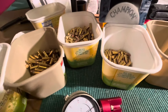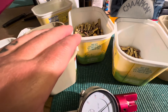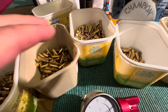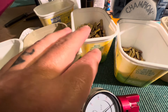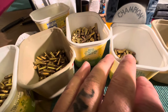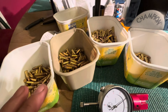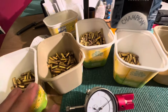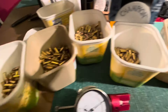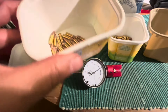When I was sorting these, I found a good portion of them were right on zero - or what I call zero. I've sorted these a little more precisely this time. This is plus or minus a half a thousandth of my zero setting. If it went to one thousandth plus it went over here, one thousandth minus it went over here, and then one and a half thousandths went over here on either side - three pieces in those outer buckets.